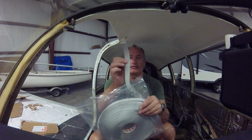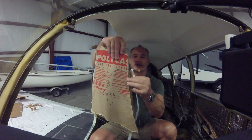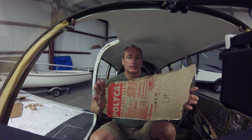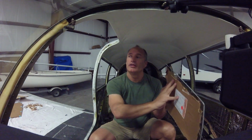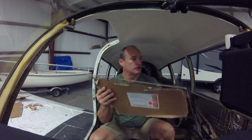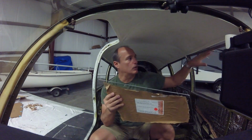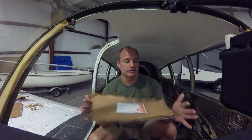So you take this protective tape, and that'll get pushed down around the edges. Squeeze it down on both sides, all the way around the window, and then just press it up into place. I'll put the trim pieces around the bottom. That'll hold it tight against the window, and then we'll put a seal from the outside around the outside edge, just to make sure no water gets inside the window frame from the outside. So yeah, I'll get started on this.